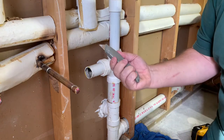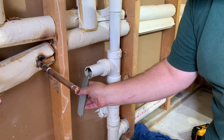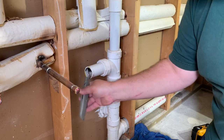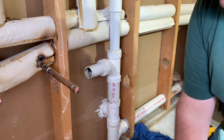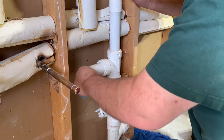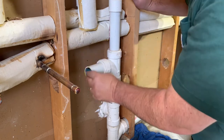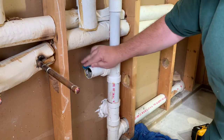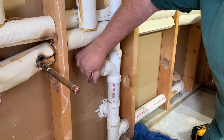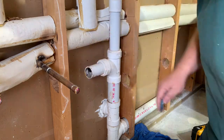You also can use a knife for that. You don't want to take too much off, but you just kind of cut the edge off a little bit. Actually, the best thing is sandpaper — just run the sandpaper around there. The same thing around the outside a little bit, making sure it's smooth with no burrs.